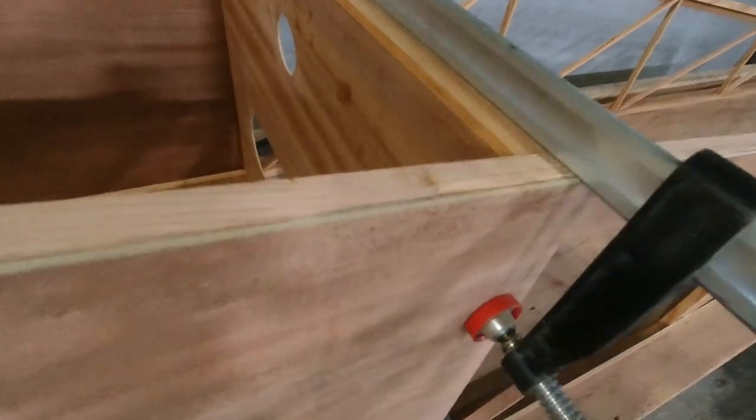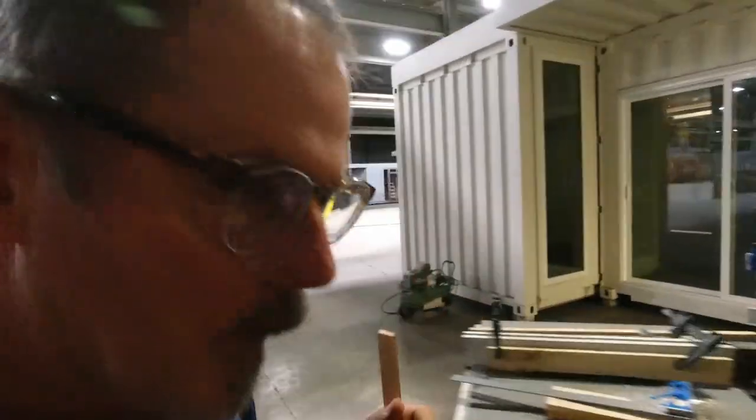So I'll take a piece of 1/4 by 3/4 and I'll put it on the bottom of that after I verify that it doesn't matter that I'm off by 1/4 inch to the center of that bottom hole. And if I am, I can always relieve that hole a little more one way or another and make it a slight oval. It doesn't really affect anything that way. So I think I've already made my decision. I'm gonna go with how I've got it and then fill the bottom.